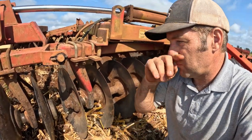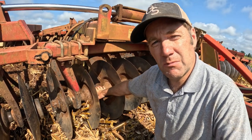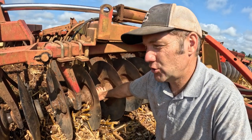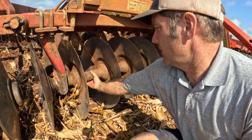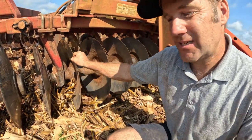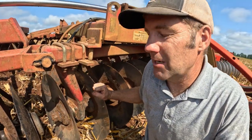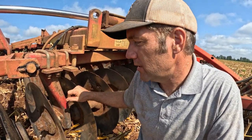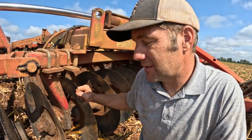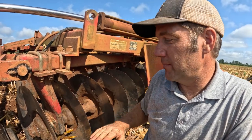And what I just saw wasn't a wobble, but it didn't look like the discs were spinning quite as fast as they should. They weren't wobbling any, but as they spun, I could tell they weren't going as fast as they should. See, what has happened is they have gotten loose. You can check everything in the morning, but just because you check it before you start it don't mean it's going to be right all day. You have to keep staring at this, watching it like a hawk, because things can change, something can break, something can get loose, and if you keep running it, you'll tear up a lot more stuff.